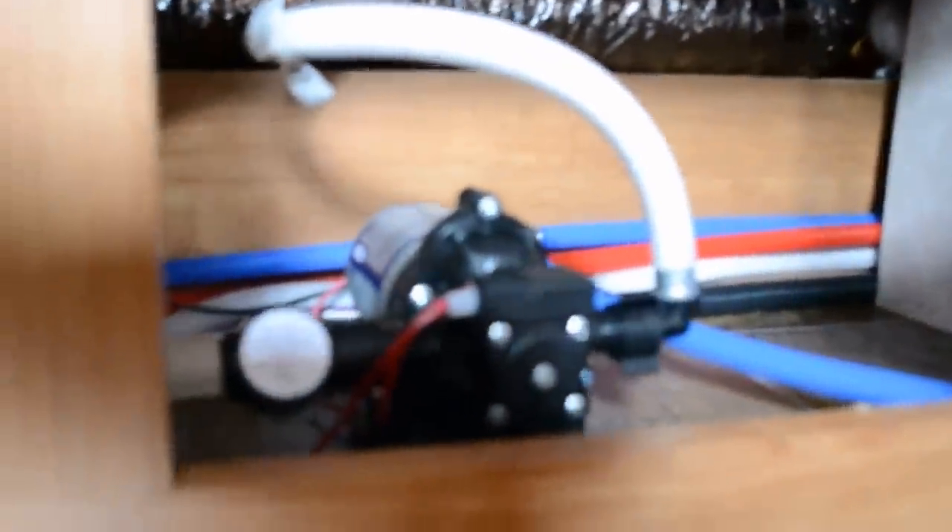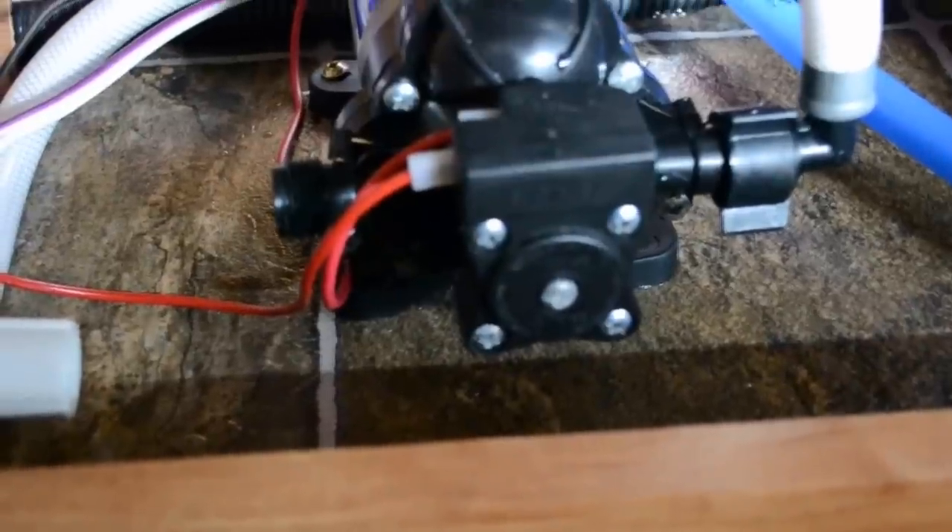Before I do that, what I do is take this water purifier off. You just screw it off. The reason for that is it's filled with water, and while plumbing antifreeze would go through it, just to be safe I pop it off, empty it. What'll happen is it will then fill with plumbing antifreeze so it won't crack. You don't want a mess on your hands when you come back to your trailer in the spring.